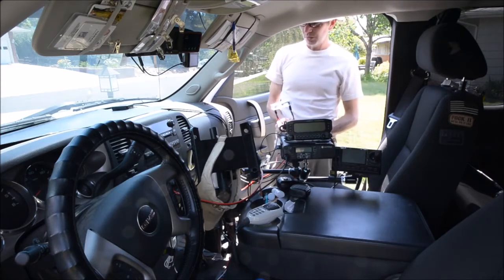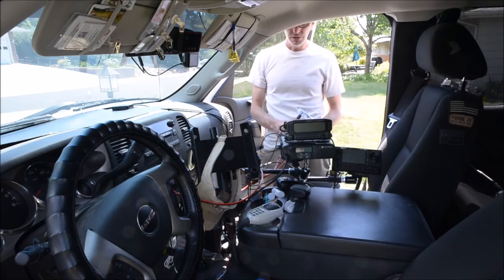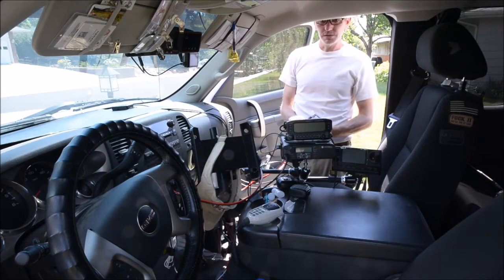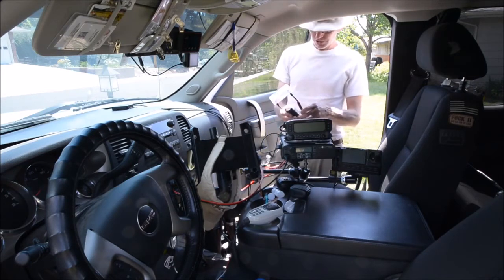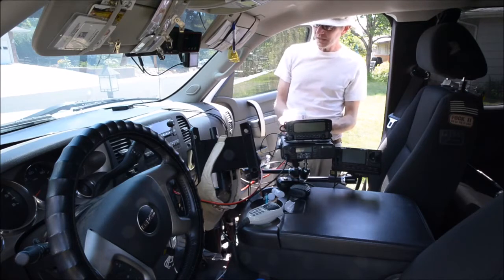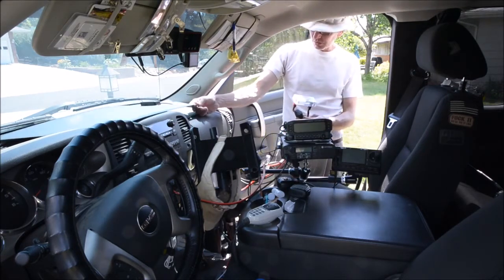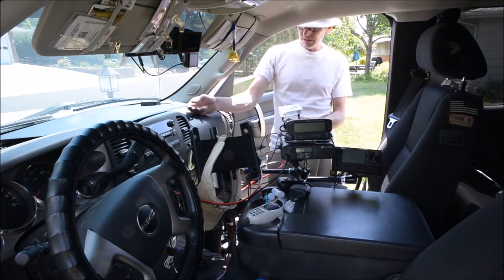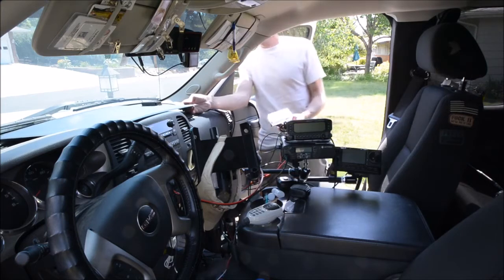I do have two brand new 240 watt panels a piece in the garage there that I picked up for 160 bucks on Craigslist. Brand new, that I'm dying to try. But I love solar, and this thing is up over 13 volts now. It's charging at 3.1 watts just right on the windshield here. So very handy, very inexpensive, weatherproof, blends right in.